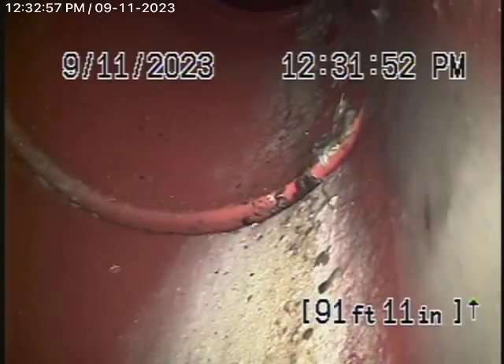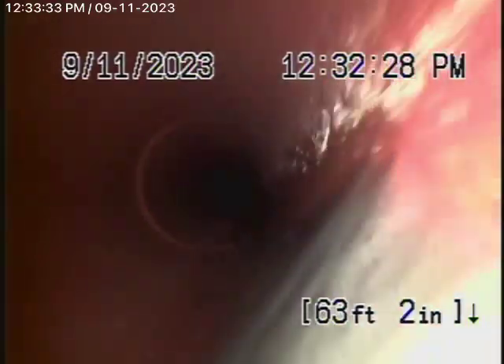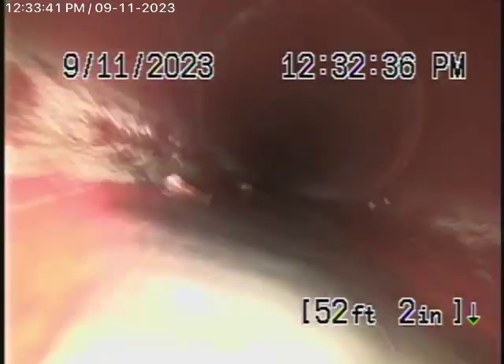You do have some roots in the line — not many, but there are quite a few spots with roots getting into the pipe. We're in the six-inch clay lateral now, coming back from the middle of the street towards the property. Remember, this is all my opinion. These roots can be easily cleaned out with some periodic cleaning. We're definitely going to recommend a hydrojet to jet the line out, because there are roots getting into the four-inch pipe as well. Overall the pipe looks in pretty fair condition — it is ABS plastic all the way to the outside of the house, which is a big plus, though there appear to be a couple of flat spots in the line.